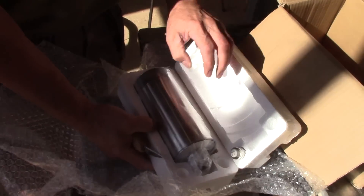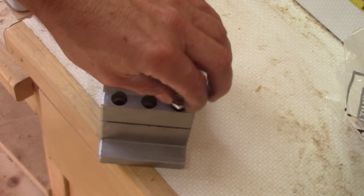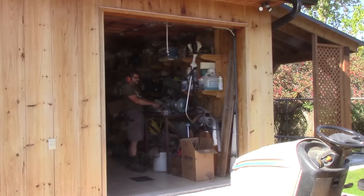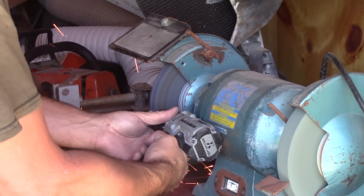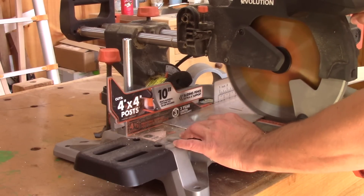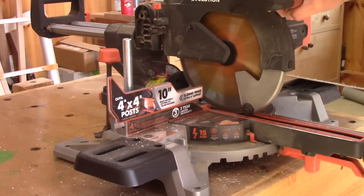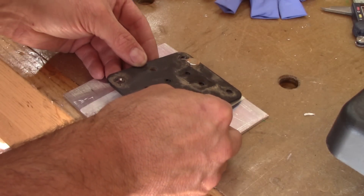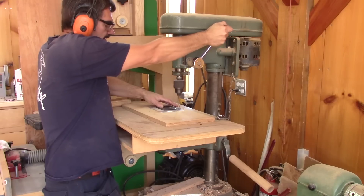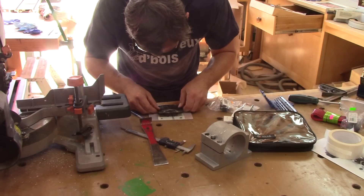This is the first modification I'm going to do. My first challenge was to find an eight millimeter bolt — as you may know, around here it's not that easy. I'm beginning by modifying the bolt for the included spindle support. Now that I have some modified bolts, I have to cut a piece of aluminum to make a new back support for the Z-axis. To make the holes at the same place as the original back, I stick it on my aluminum and use it as a guide to drill the holes. Since my new backing is bigger than the original, I move the original back down to make the last holes.